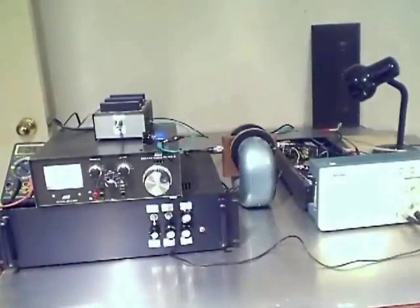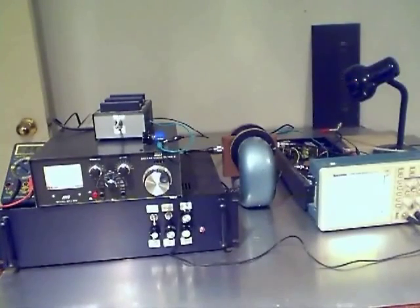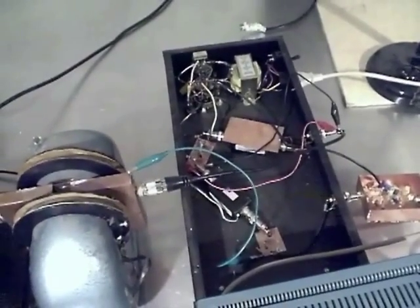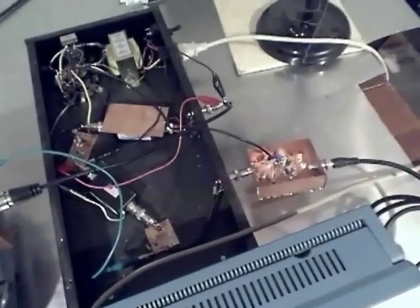The signal from that then goes to our receiver, which is behind the oscilloscope. I'll show that a little closer — there's the receiver down there, which uses two linear amplifiers. It's got its own power supply and a third amplifier on the end, which gives us a total signal amplification of about ten thousand times. The two linear amps are about ten times each.